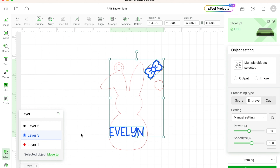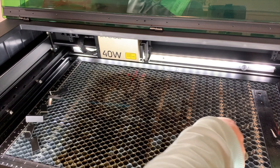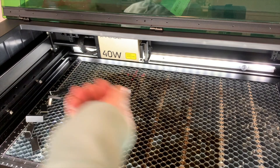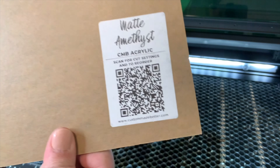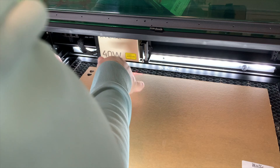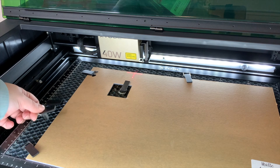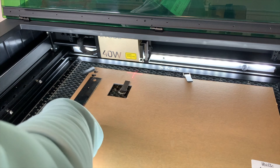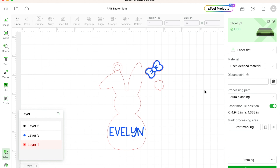Now we are at my favorite part, which is making the laser do all the work for me. I'm using the Xtool S1 — you can see the bed is really dirty. I have a honeycomb. I'm going to elevate the acrylic with quarters, wood, or acrylic pieces. Purple is gorgeous — I'll put the link below. I always elevate everything if my honeycomb looks like that, and it doesn't matter if the acrylic is masked or unmasked. I always elevate. I make sure it is level and then I pin it down so everything is solid. I'll grab a ruler just to make sure I can fit my little bunny over here — and I can.